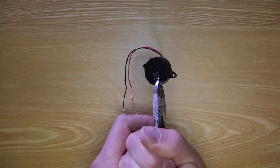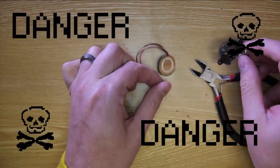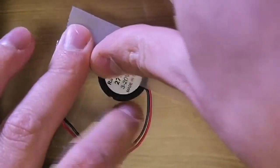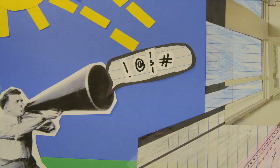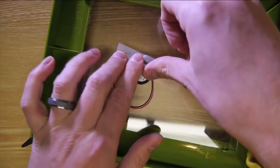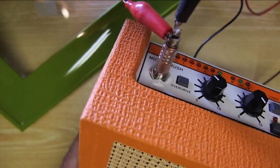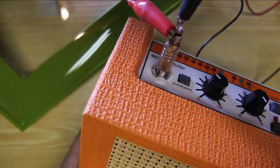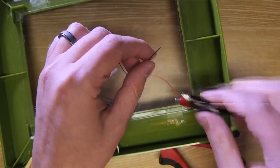You're going to need to cut the plastic housing off of the piezo buzzer. Get an adult and have them use wire cutters, and be careful. Take the flat side of your piezo buzzer to a single piece of glass. Most house windows are going to be double-paned, which is two pieces of glass — this is to stop sound and heat from traveling through them. Some older windows or doors might have a single piece of glass, and that's what you need. Connect your two alligator cables to the two arms of your eighth-inch audio plug, then connect the other two ends to the red and black wire coming off your piezo buzzer.